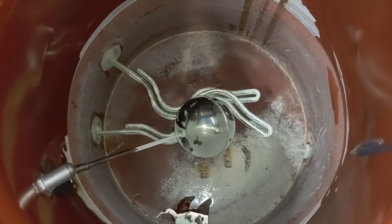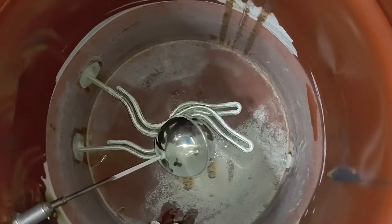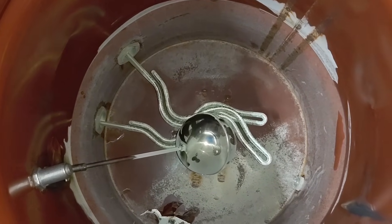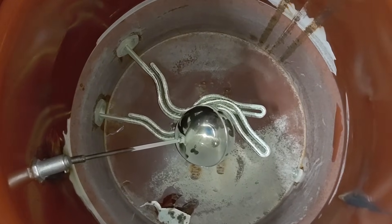In a perfect world, I also would have lined up those elements a little better — directly across from each other so they weave into each other. These elements do come bent and do weave into each other, but I figured putting one on top of the other would be easy to replace, and in the end it really didn't matter. The thing heats up so fast with 11,000 watts flowing through it. If I could have put the elements across from each other, I'd keep the water level lower, which would mean faster steam — but instead of 5 minutes to produce steam, it just takes 15.